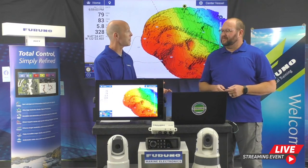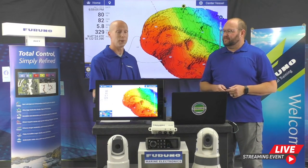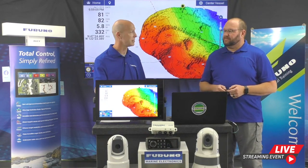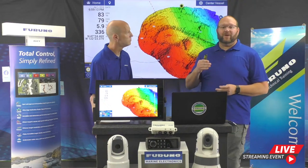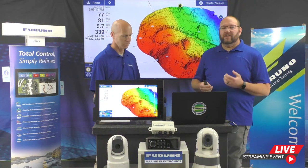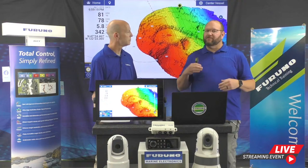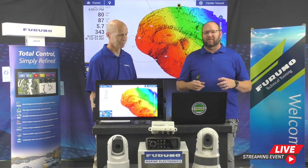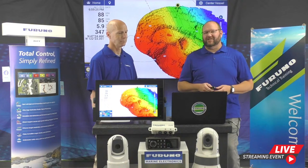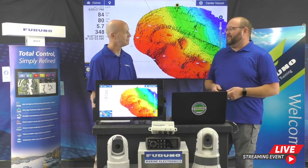And you know what's really nice about this, Brandon, is you simply drop your Fusion radio into your NMEA 2000 network and you have control of it from your TZT3. Yeah, it makes it really simple. One of the things that you do gain if you still use the Ethernet connection, if you have one of those style radios, is that it'll pass your album art. So if you really want to see those pictures off the albums, which most people buy digital now anyway, right? Then you need the Ethernet connection. Otherwise, go ahead and do it the easy way with NMEA 2000.